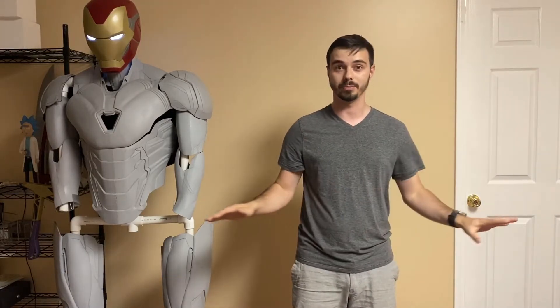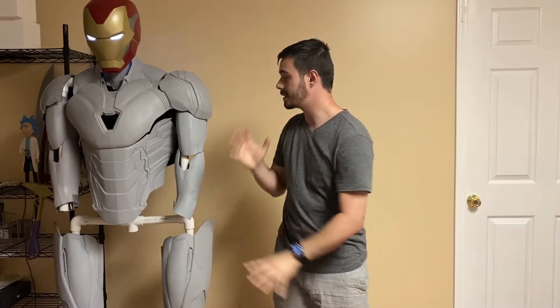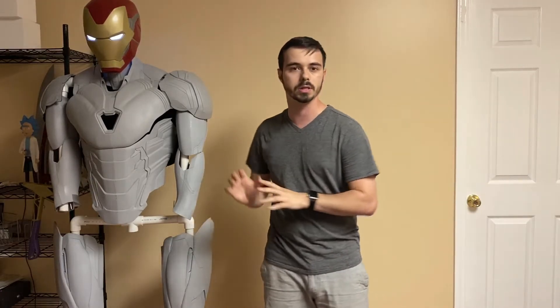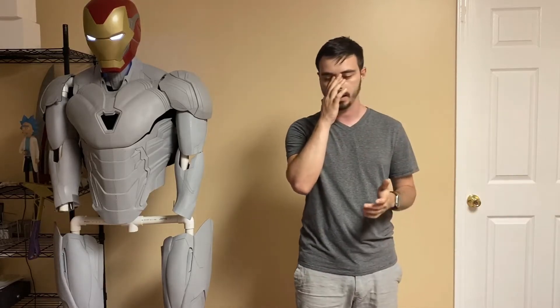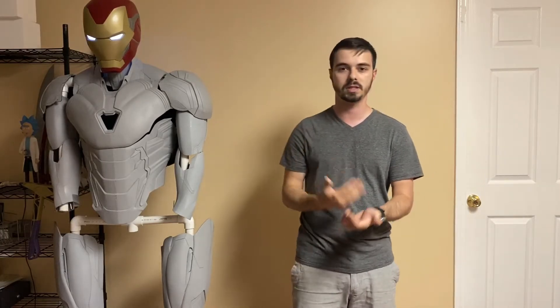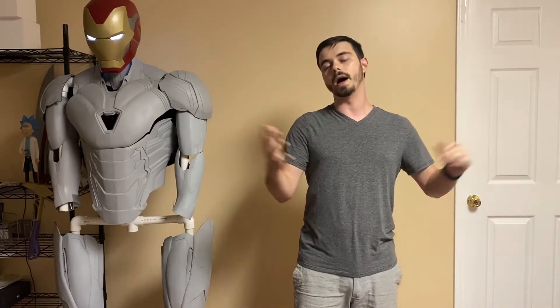It comes with auto bed leveling, but that's just to compensate for small differences. Having really good leveling can make or break your prints — the quality goes up and down. I actually didn't level my bed for about a month while I was printing the whole Iron Man suit. The bigger prints, the quality isn't as noticeable, but certain things were just not as optimal as they were initially. I was wondering why it was getting worse using the same material, same PLA, same settings. Lo and behold, I leveled my bed and everything started looking much, much cleaner and better.